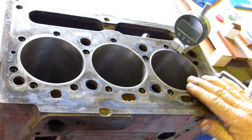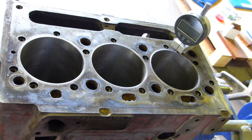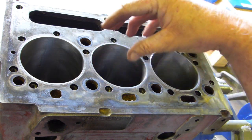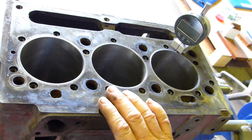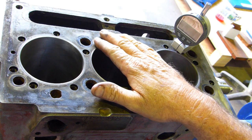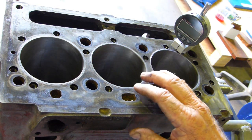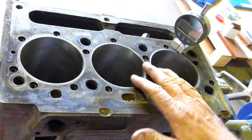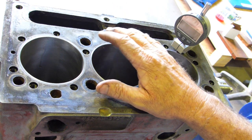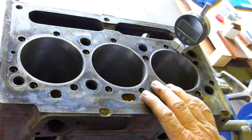I have the liners in and I only have one little clip of where I pushed the liner in — my camera's playing up, the zoom's playing up. It went in a bit too easy and I thought, well, in the past when you get the old liners out — these are a press fit liner — you put ice in them, heat the block up, and they're actually a bit of a struggle to get in at times. I've had people break them getting them in. So you don't know what's been done to a block before you come along. With these new liners, dry, I couldn't get them in, but with a little bit of oil or Loctite I could actually press them in with my hand, which in my opinion is a little bit too loose.